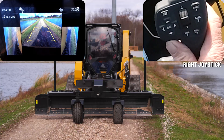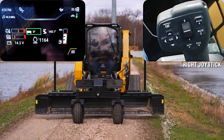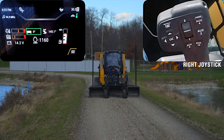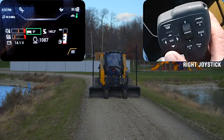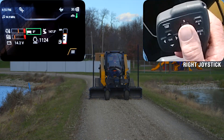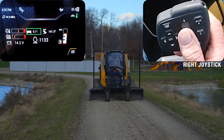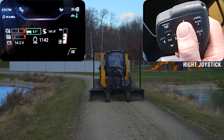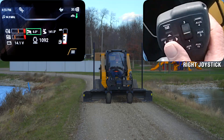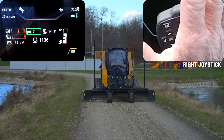I'm going to get ready to start doing a little bit of grading. With that I'm going to have the assist mode on — as you'll see the green is here. I'm going to grade just a little bit and then go ahead and memorize a slope for the crown. As I'm grading you can see it's starting to pick up the material. I can move my wing around on the left side and move my wing around on the right, giving me a ten-foot grading beam.